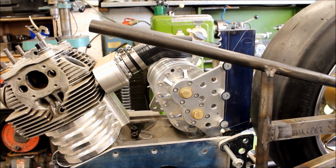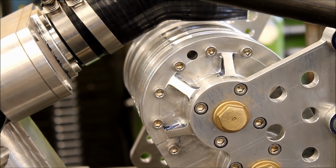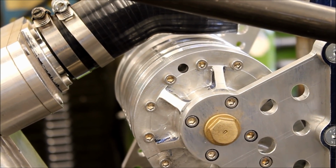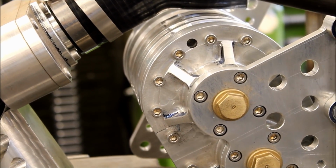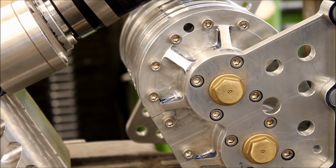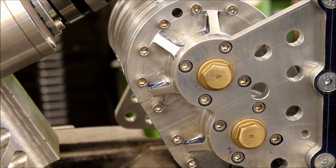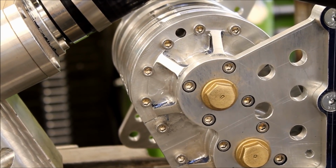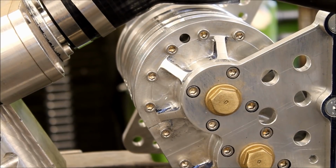Let's just zoom in on that then. Okay, so we've zoomed in, so it might be even more wobbly, but now you can see how those webs have been machined back. And you can just see a line there, can't you? That's where the cutter came round. It looks really nice, actually. When you're working on the rotary table, you just keep setting up and moving to end up having everything flowing perfectly. There are a few little nicks here, but it's handmade, mate. That's the machining that is decorative, not the critical parts like bore centres and rotors. Looks cool, that's the main thing.